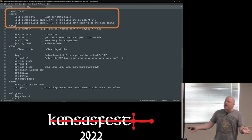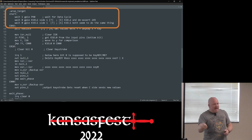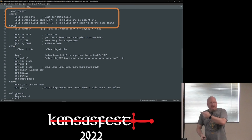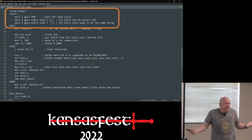But I put on my WAS hat and said, you know what? I've already got a buffer chip that does the voltage translation anyway. Let's just turn that into a latch. So on revision 3 of the Rev 2 keyboard interface, I put in a latch, it data qualified the signals, fixed the problem. I could have probably fixed it in software, especially with help of my friend that cleaned up some of this, but it was like, we'll just put a latch. We already have to have the chip anyway, so we'll just make the chip more useful.